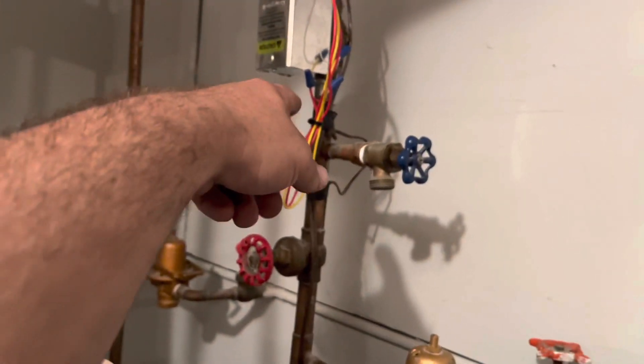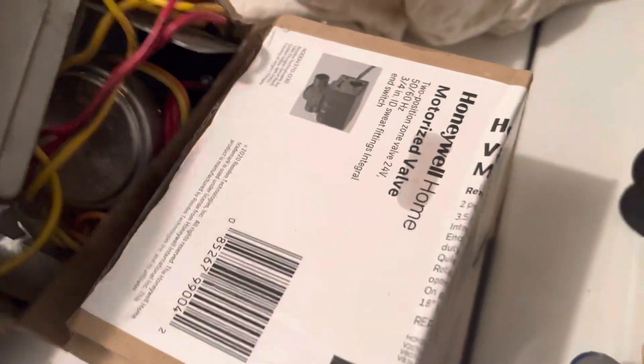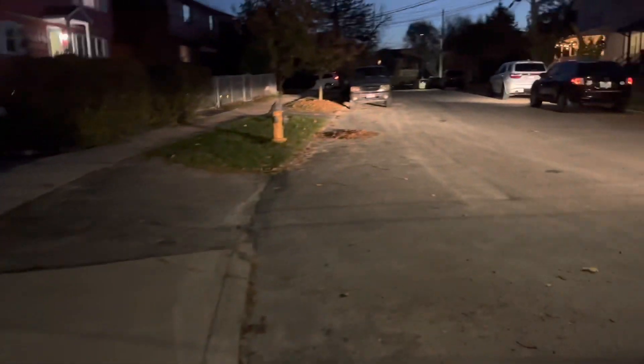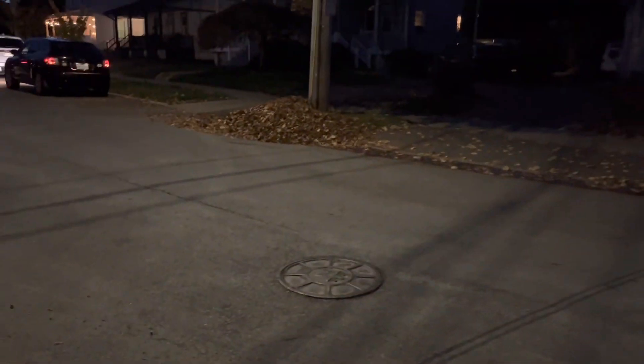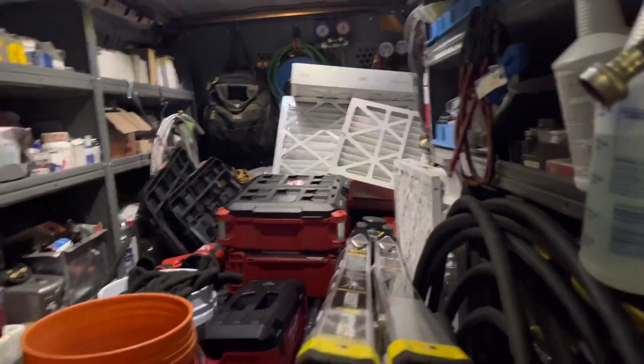Had to take the guts out because the old Honeywell plungers on the tops don't match up with them — or to my liking anyway. That's all I did. She's heating though. It's hot, hot, hot. Alright guys, that was just a quick zone valve change — two zone valves, and then purging the system. Those are some old boilers, but they're heating. This van's a mess.